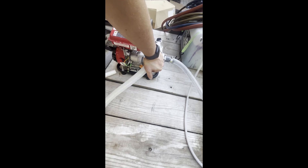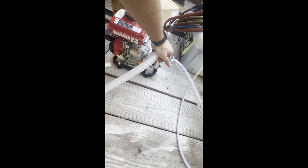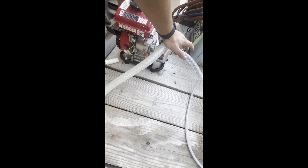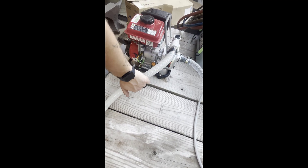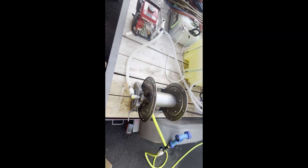I think it's a centrifugal pump design, so it just won't really overheat. Not saying you'd want to stay off the gun too long, but I've had minutes where customers were out there talking to me for 5 to 10 minutes and the pump never got hot — it's perfectly fine. I've run 5% mixtures of bleach through here for roof washes, house washing, and heavy post-treats on concrete. I flush it out every time, as I always do with any of my pumps. It holds up just fine. I plan on doing an update video in the future to show if it breaks or something catastrophic fails, probably within the next couple of months, just to make sure everything's working fine.